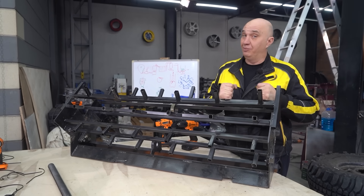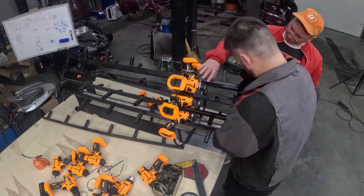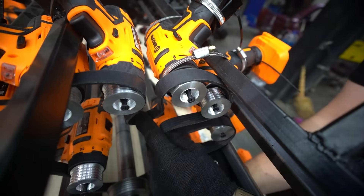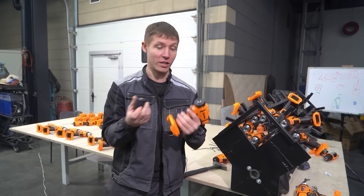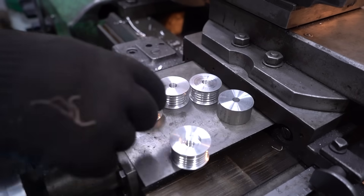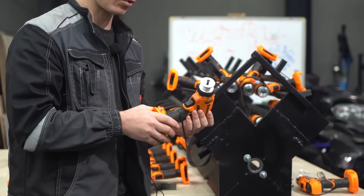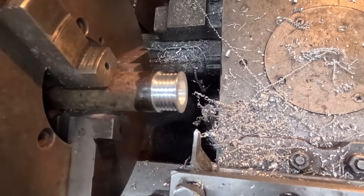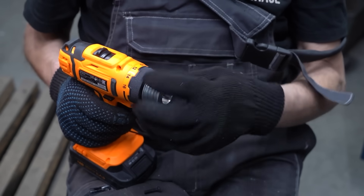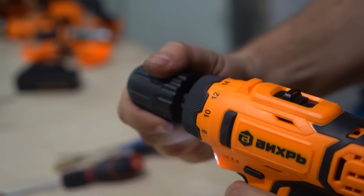We're using regular V belts to transfer the torque. We didn't want to fit any additional pulleys to the chuck — instead opting to remove those entirely and replace them with pulleys. That'll free up some space and it's also just the correct way to do it. It'll get rid of any wobbles, vibrations, or other unwanted movements. We're machining the pulleys ourselves using a lathe and they are made from aluminum to make them lighter and remove some load from the motors so they spin more freely.